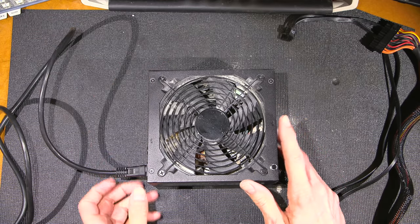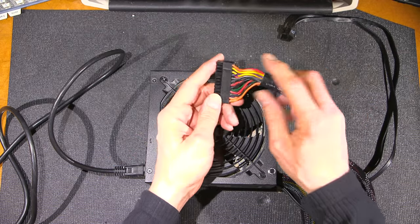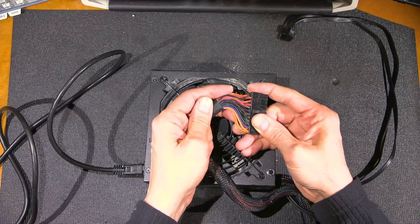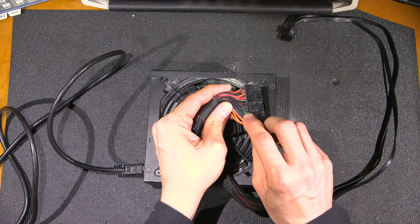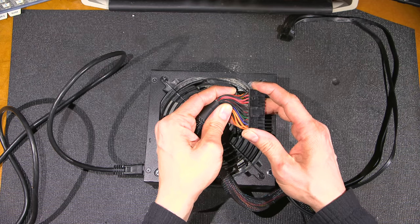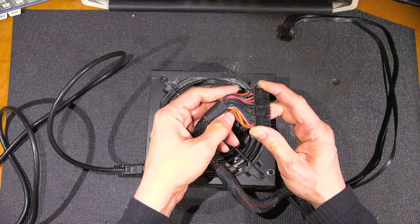Now, the reason the thing isn't turning on, and I have the power supply on, right, but it's not turning on, is because it needs a signal from the computer itself to turn the power supply on. So usually in the computer itself, there's a FET or a transistor that will connect this green lead to the black lead here on the connector. Usually an open collector, open drain circuit or something like that in the computer will do that.